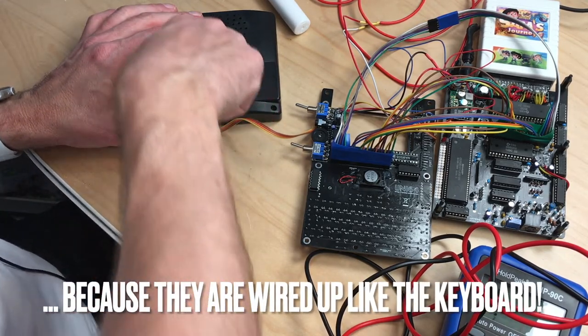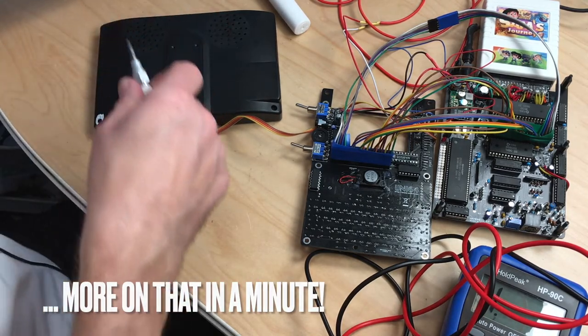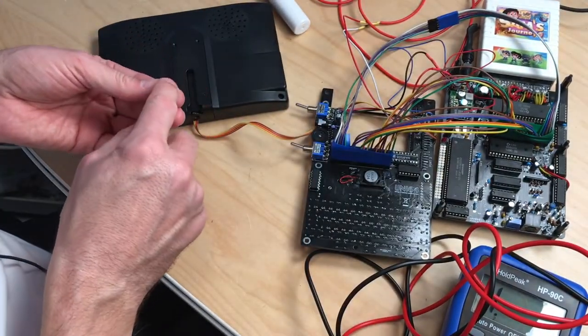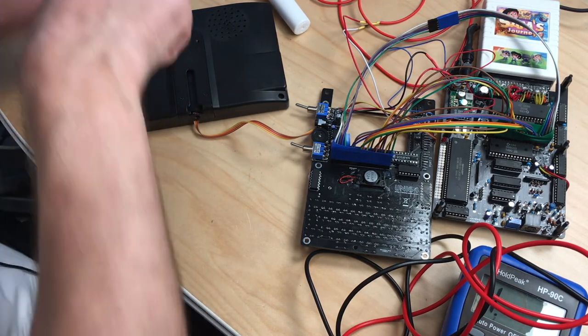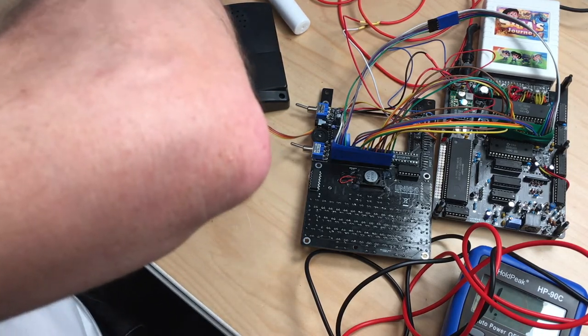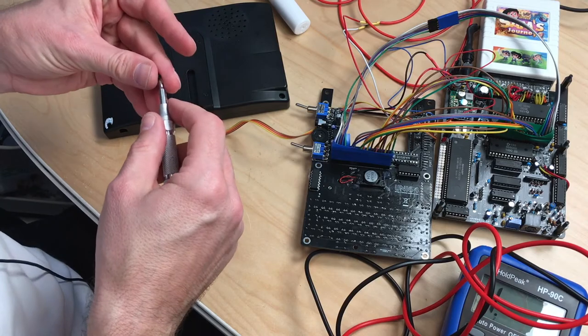Only one fire button works, and that is not enough. And the joystick ports you can clip on don't work either. I already switched through three CIA chips. Doesn't make a difference. So there must be something on the board.